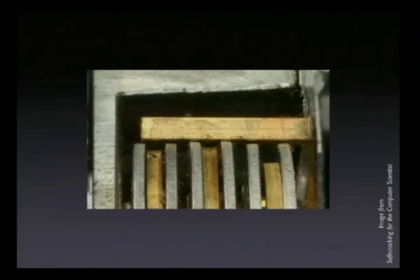Now, how do we manipulate this thing? Well, the wheels aren't perfect. All the feedback you have to work with is what you can feel or hear from the front of the safe. To open this, it's the same way as when you pick a normal lock. You're relying on the fact that the wheels are imperfectly made, so that one of the wheels is going to be bigger than the other. When the gate in that wheel passes under the fence, the fence will be able to drop down just a little bit, and you'll be able to hear or feel it dropping down. It might show up on a graph, as I'm going to talk about later.